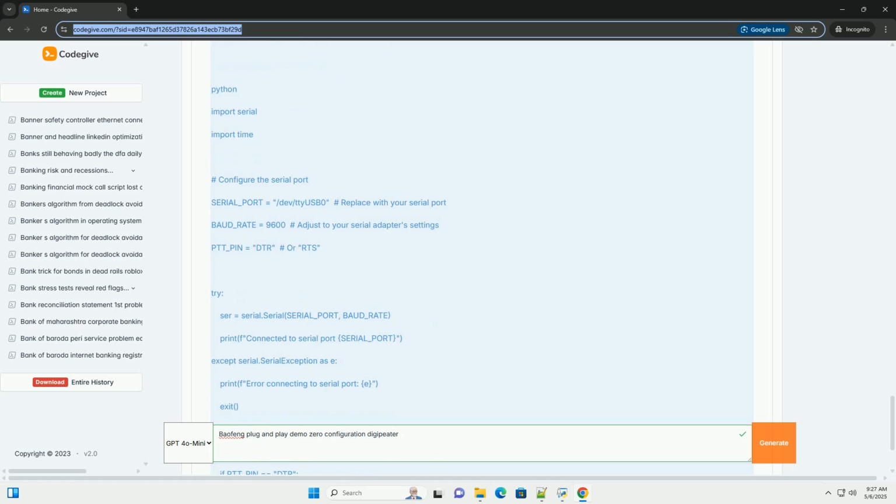5. Update and upgrade: run the following commands to update the package lists and upgrade installed packages. 6. Install APRS software: there are several options for APRS software. We'll use Direwolf, which is a versatile and widely used software modem/encoder/decoder for APRS.